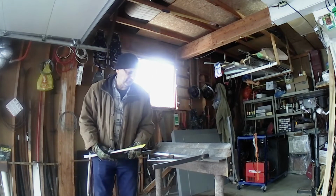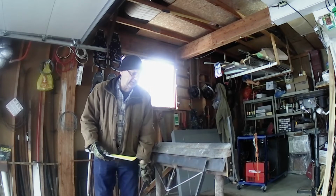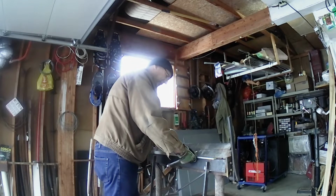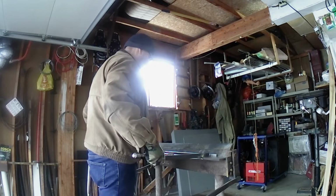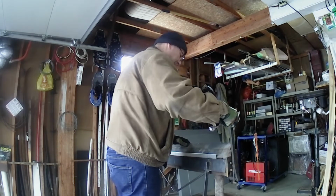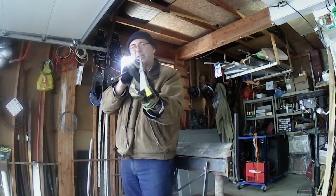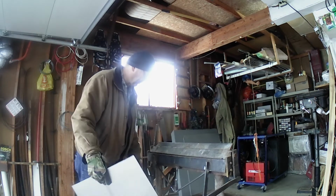Although the brace is still here, it's loose. It's not providing a stiffener to the brake. So let's put this piece back in here and make another bend as it would have been before. Well, that's light material. Only a slight distortion. We got a piece of the same stainless steel we're using before, 40 thou.